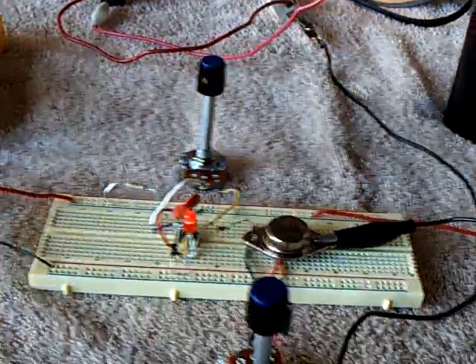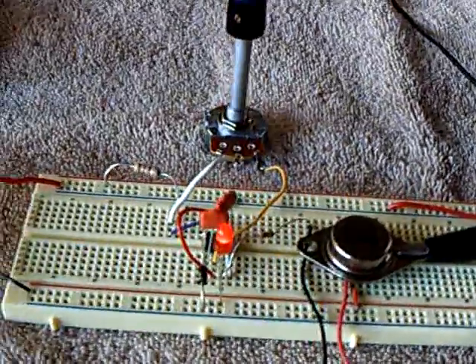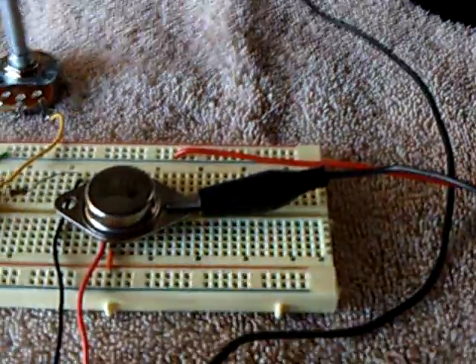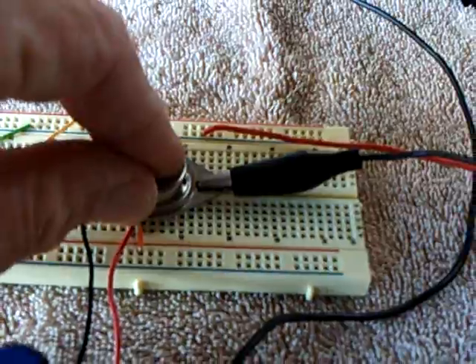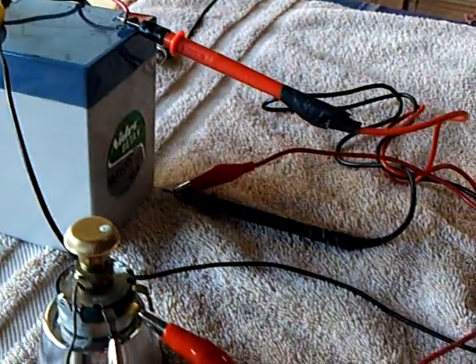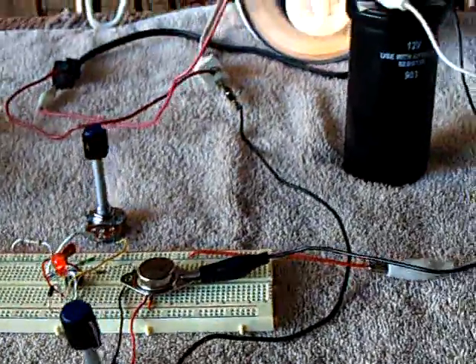There's no Bedini circuit — this is just a 555 timer circuit, a very simple 555 timer circuit with this big power transistor. Like I said, you have to put a heat sink on this if you're going to run it for very long or at higher voltages. I've got this running on a 12-volt battery, and if you kick this up to 15 volts you're going to heat that transistor up, so you've got to be careful about that.